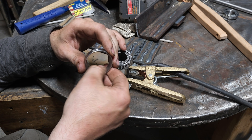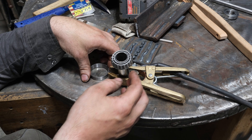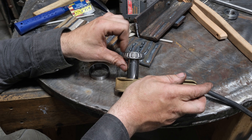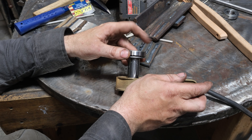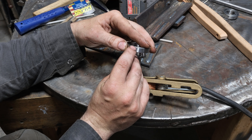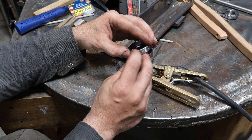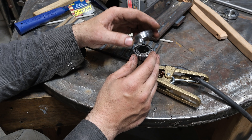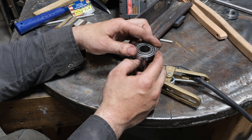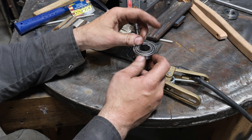Surprisingly, I don't see any hot spots — it's still kind of warm though, so a lot of current was definitely passing through there. I also don't see any arc marks on the bearing itself... wait a minute — we do have an arc mark here. Yeah, that wasn't there earlier. So I see an arc mark on the outside of the bearing race right here. It definitely arced there, but the path to ground through the bearing must have been decent enough that heat was spread over a bunch of rollers, and it was able to handle it. Had there been grease in here, that likely would have made it worse.